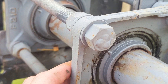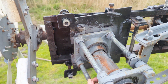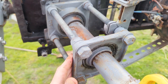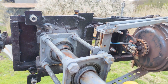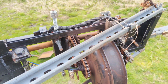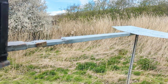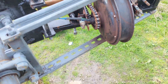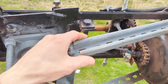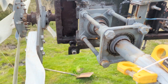Rust everywhere — this is Britain. Nice close-up look at the double bearing, which is very good — super strong and works perfectly. Thanks again for the donation from Steve who helped pay for that one, because I was just going to use one on the bottom of the frame. But then it was obvious that with all the weight — the tail might only weigh 15 kilos, but sticking out like that, the force it's putting down on the back end is significant. The struts, which look a bit naff but are really strong, split the load, and all the weight goes through these struts then through this bearing — super solid.